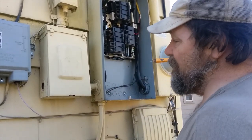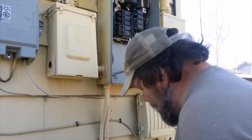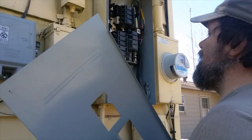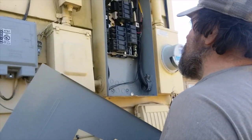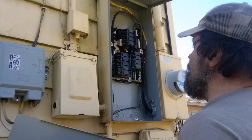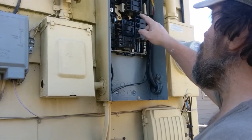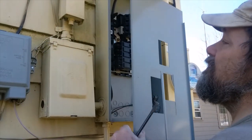Everything in here is hot right now, energized, so if you just reach in there and touch something it would fry you. Anyway, Donald Blue Collar DIY — thank y'all for watching, don't forget to like and subscribe. If you've never done this before, it's dangerous — best to call an electrician. But if you feel confident, this is how you find that dead leg and it'll tell you which breaker it goes to. Make sure the breakers are on, because if they're off obviously there'll be no power. This one's on, all of them are on — so this is our dead leg on the 60-amp double breaker.